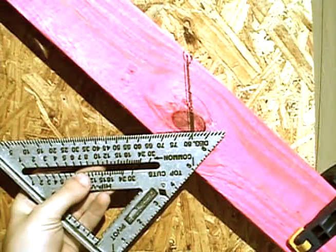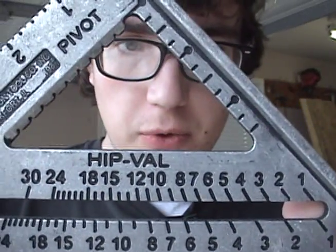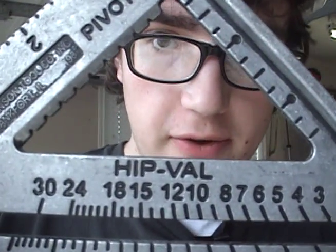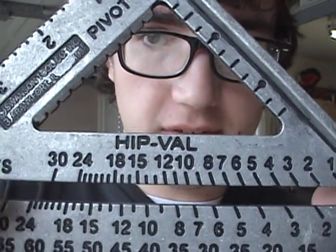Remember on the first episode when I showed you how to mark your plumb line, bird's mouth, and tail on the common rafter? That's what we're going to do with our hip and valley rafters too. Now, do you see these numbers under the word 'hip and valley' on the speed square? These numbers are for the rises of our pitch measurements for hip and valley rafters. Just remember that these numbers go over 17 instead of 12 this time.